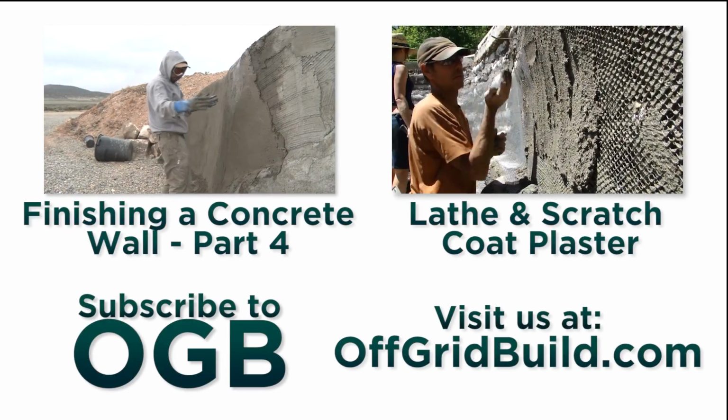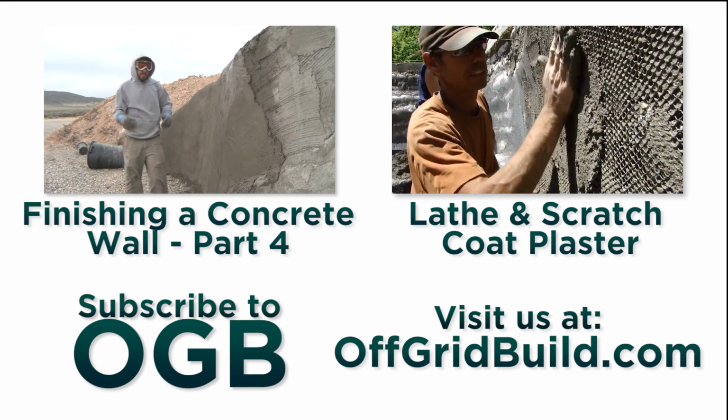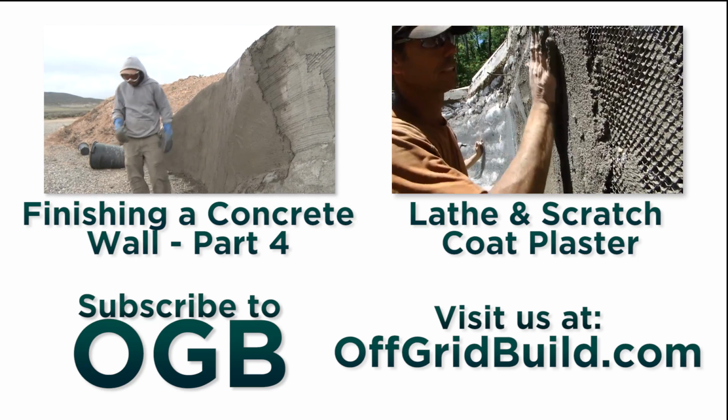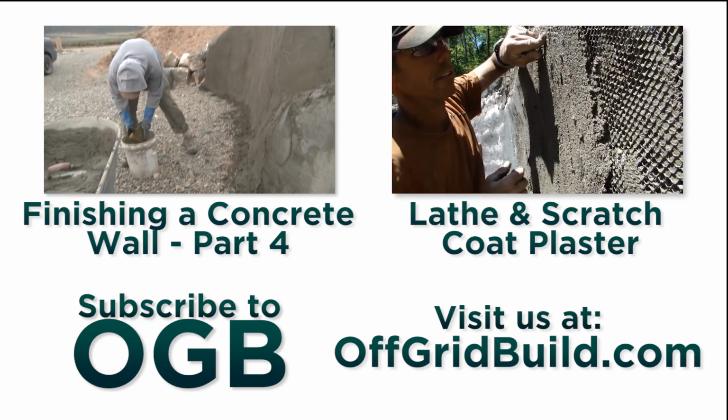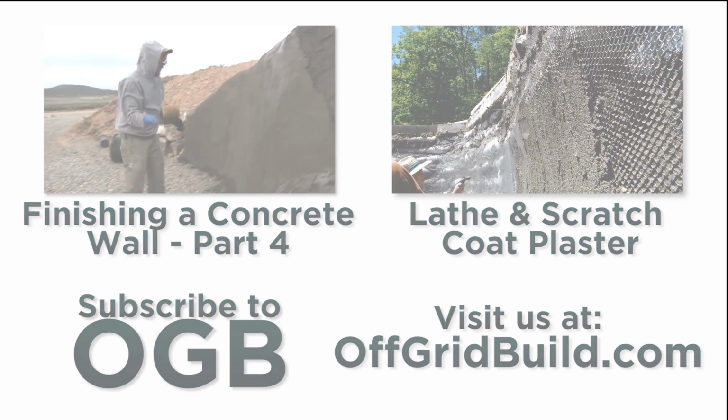Alright, so I've just plastered a little area about this big, and I want to come back now. Since it's so windy, this mortar is setting really quickly. So, come back with a sponge squeezed out, a grout sponge.